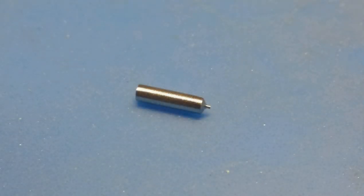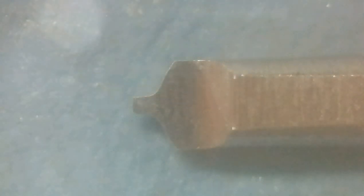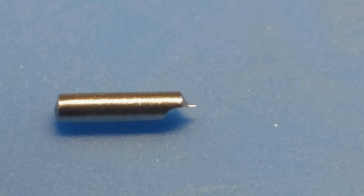The second and subsequent cutters I made on a lathe. As you look at pictures of this type of cutter, you have the benefit of ensuring that each side of that tip is going to be shaped perfectly. But the downside is that once you grind off half of it to make it into a cutter, the tip is actually very weak. I was concerned it would bend or break in use, even though it is steel cutting the much softer brass. And as it turned out, on one of my attempts, it did break off — I had made that center point too thin.